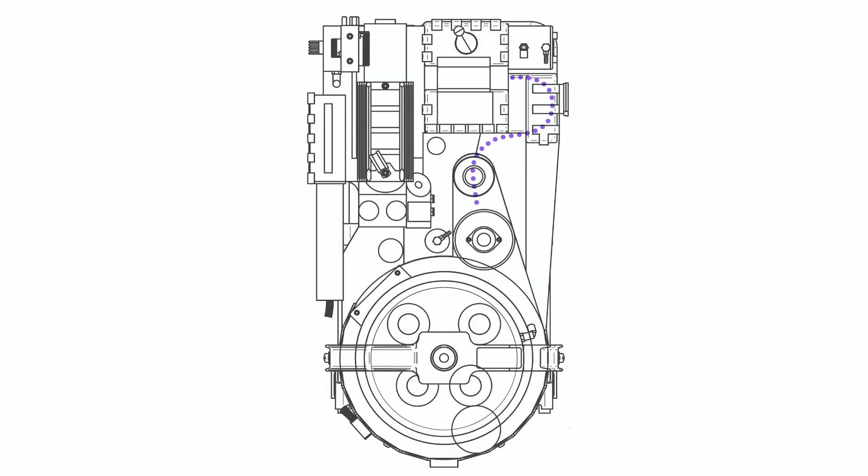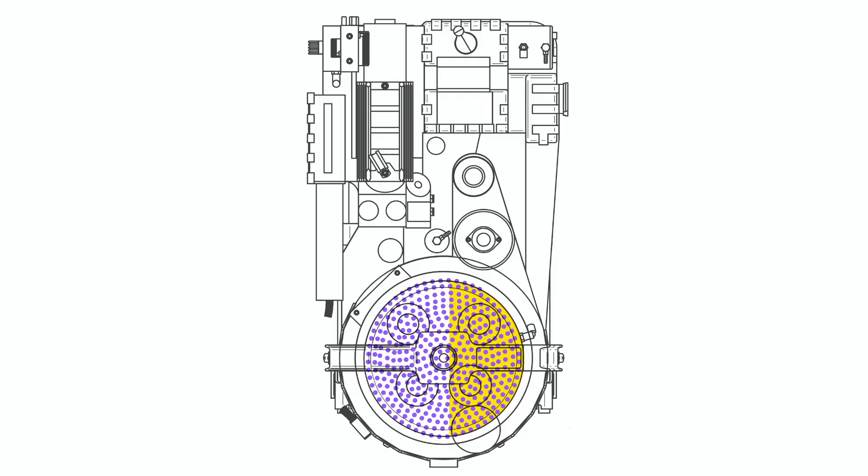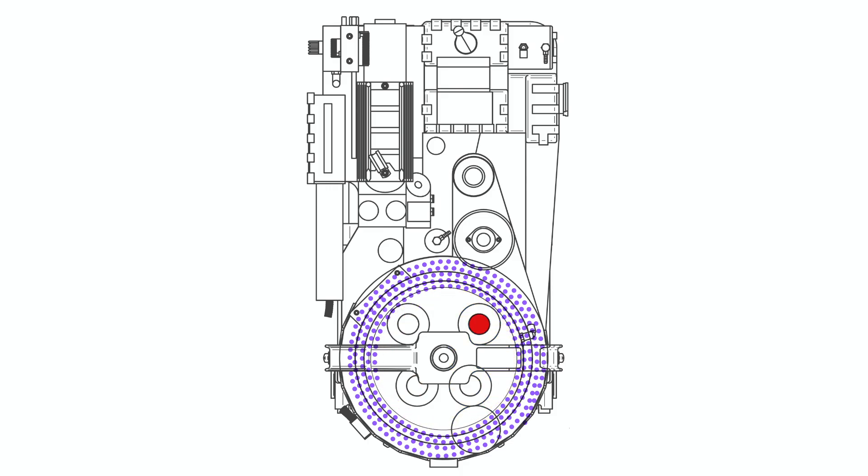With energy from the PPD, the hydrogen gas actuator pulls hydrogen directly into the ionization chamber, where a thorium-tungsten filament heated white hot ionizes the hydrogen gas before it is sent to the cyclotron. The ionized hydrogen is injected through a three-eighths-of-an-inch copper rod protruding into a vacuum-type ceramic feed-through. The particle emerges between two hollow D-shaped electrodes called dees. An oscillator alternates the current so the negatively charged hydrogen is attracted to the positive dee and repelled by the negative dee, causing the particle to spiral outward, increasing velocity. The particle exits and strikes a carbon extraction foil, stripping the electrons and leaving only an accelerated proton.